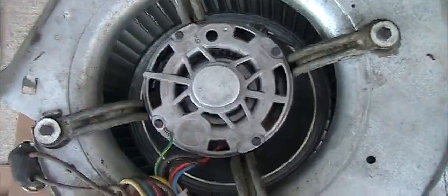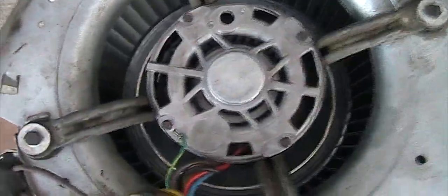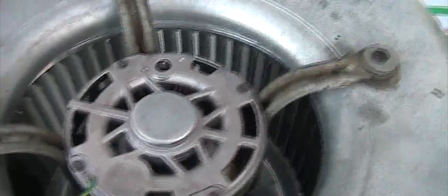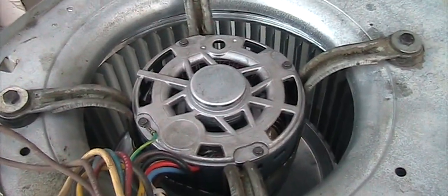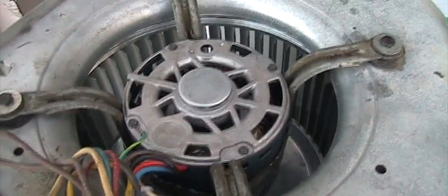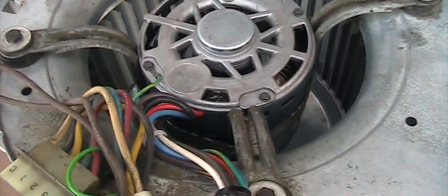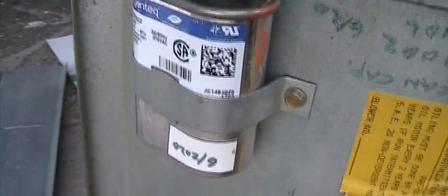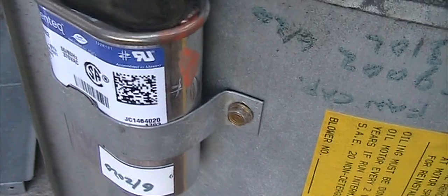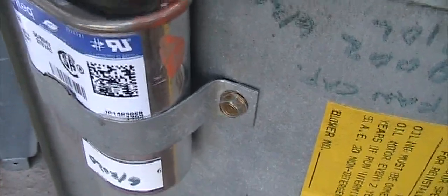So when you tighten the bolts, just do a pattern, and also don't tighten really tight. As long as they go in, tighten a little bit all around, so eventually it all will go in perfectly. And you're supposed to change the capacitor, but I changed it already, so I'm not going to touch it. I just want to make sure the problem is the wheel and the set screw.